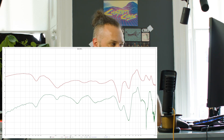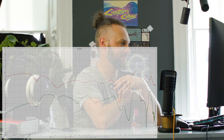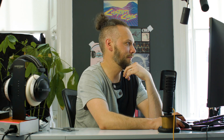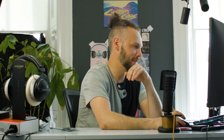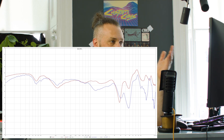As I thought, the bass — well, the whole thing is much quieter — but the bass in particular has dropped off, and the treble is all over the shop. Distortion interestingly: that's your stock distortion, and you can see there's a big peak around 5kHz. With the ring driver, there's no distortion in the high end but tons of it in the mid range.